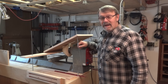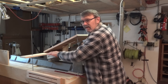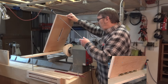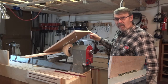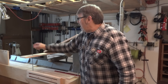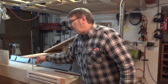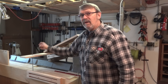Let me give you a rundown on how I built this jig. If you didn't see the previous video I suggest you take a look — I'm not going to re-explain that end; it's only about six minutes long. The first change I made was to put a piece of piano hinge along here so I can adjust this angle to anywhere I want. On this end, I've got a piece of ready rod coming down and resting on top of the bench I made for my lathe.